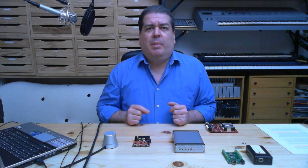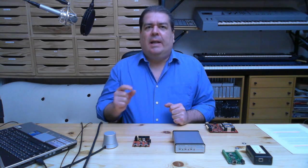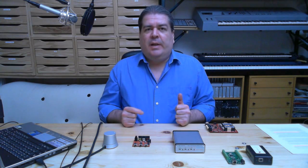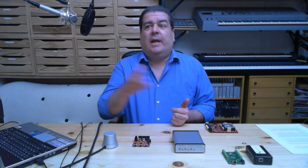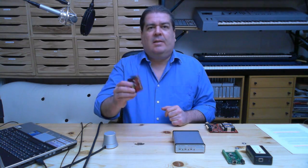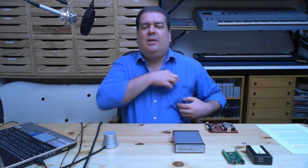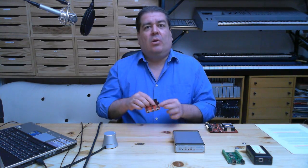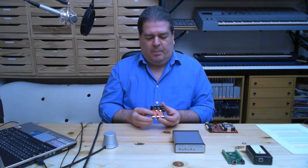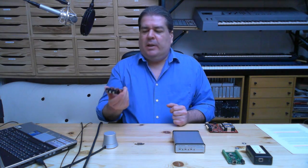The unit could be battery-powered first, because battery is a great source for a clean power supply to the DAC — that is one key to getting good sound quality. The other thing was that I wanted it to be small enough to go around at parties and friends' places and have them listen to it. So I designed a small board that you can put in your pocket. You can solder and attach a wire and battery clip, or power it through an external transformer compatible with laptop power supplies, but it can run on batteries.